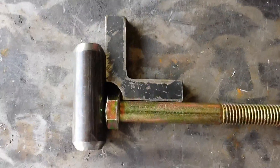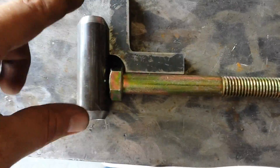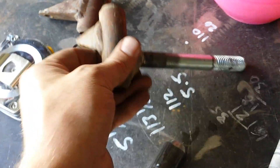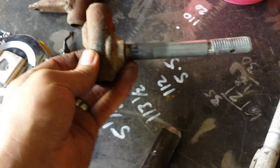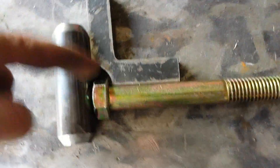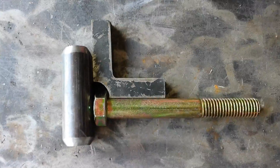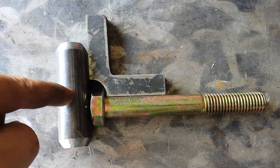Here's how I'm lining it up: this little cutout is just to make sure we don't hit the nut end of the bolt. I'm positioning this about an inch and an eighth from the bottom — it doesn't have to be exact, I'm just basing it off the old one. The arm that comes off here is just above it; I want to give myself adequate room. I just need to make sure I'm going at a downward angle and that I'm close to the bottom, otherwise I'll have the wrong angle. Then I'll clamp things down so they don't move when I tack them.